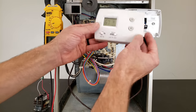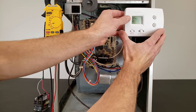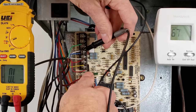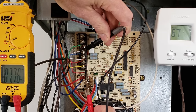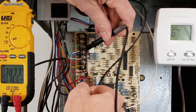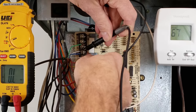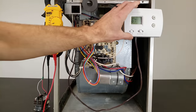Now we can do this again with the thermostat on. If the fuse is blowing when you're not turning anything on, we can leave the thermostat in the off position and auto and run these tests again. This time we're reading in mega ohms — 7.6 mega ohms, which is very close to OL. Testing each wire: OL, OL, OL. So we know our thermostat is not the problem.